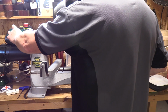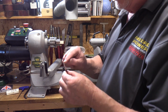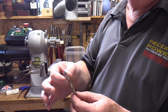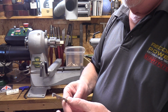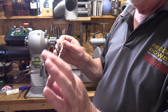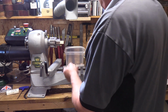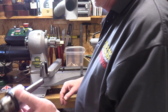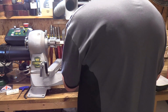So that's all alright. So the next thing is I'm using a step drill. And again, it just lends yourself to a little bit more accuracy. If you take it nice and easy when you're doing this, you should get a positive, nice clean hole on there. So 7mm on this occasion for this one. And I want a drill chuck. So I'm using a 1/2 inch drill chuck.